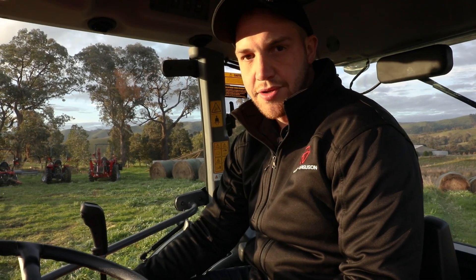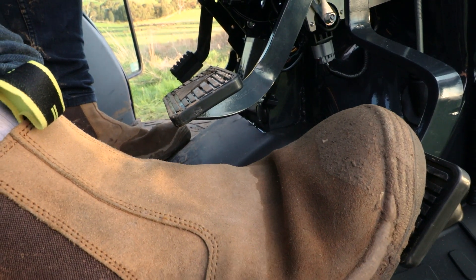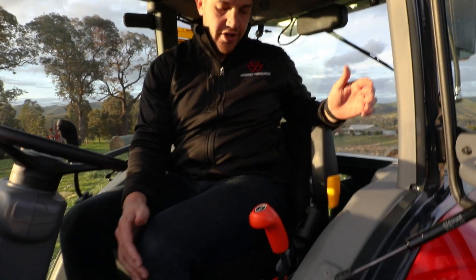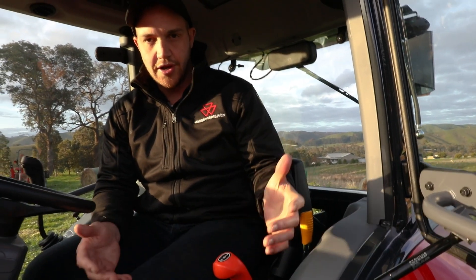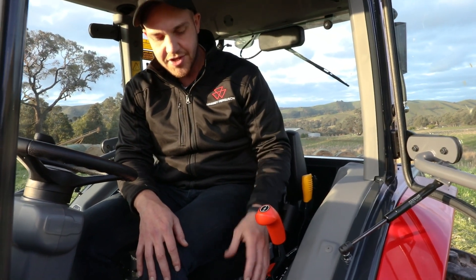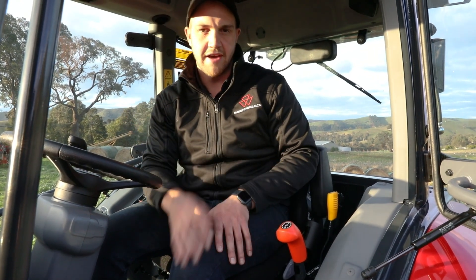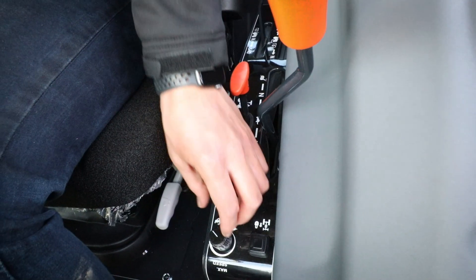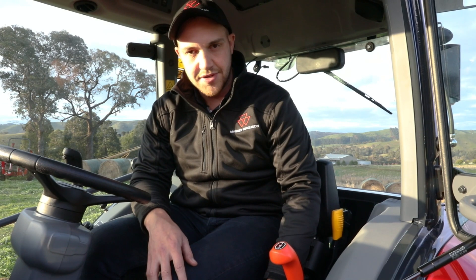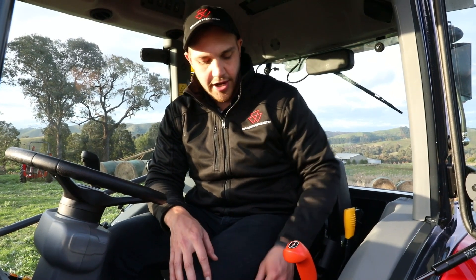On the right-hand side on the floor, we have two separate pedals: one pedal to go forward and another for reverse, specific to our hydrostatic transmission — very simple to operate. Over on the left-hand side, we have the range lever for our hydrostatic transmission to select high, medium, or low ranges. We also have additional transmission controls including a cruise control button to maintain a set forward speed, a maximum speed dial to set a speed limit, and a slow and quick response dial to change the sensitivity of the pedals as I push them.